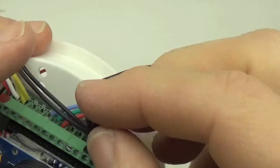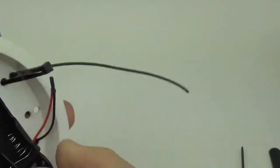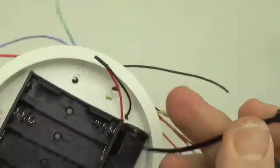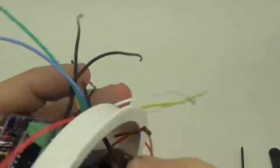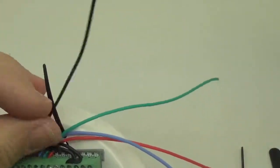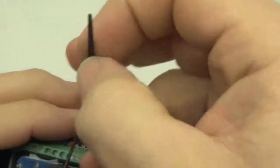I also do some tricks with my ground wires, so I'm particular about my LED. Oh, I got that one backwards. I'm particular about the limit resistors because I actually use the LED to generate noise when I'm sampling with the ADC. I use it to make noise for a technique called oversampling, which lets you read pretty much any resolution you want. Even though the ADC on an Arduino is not that great,